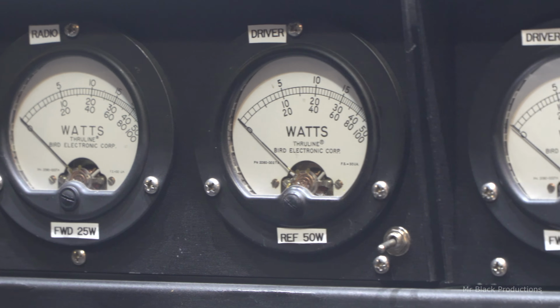And what we're wanting to do is we're going to backlight each meter from behind its panel, but then we're going to also backlight all the way around the edges. Okay? Because we figured out that there's only three LED pads inside each meter. Now, when I did this for myself, there was like 20 inside of each meter. That was because the padding was different. So it's just a cool effect. I was going to backset the meters and backlight them anyhow. But this will actually add more light to the meter panel itself.